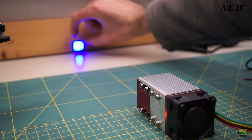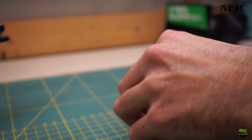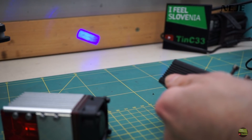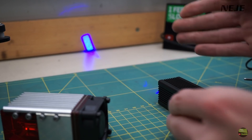Here I notice another great property of the 40W model: the laser beam is totally squared even at 40 cm distance. If I plug in the 30W or 20W laser module you can see that their lens can't focus the beam as well, so power is lost by spreading the light instead of concentrating it into a single point.